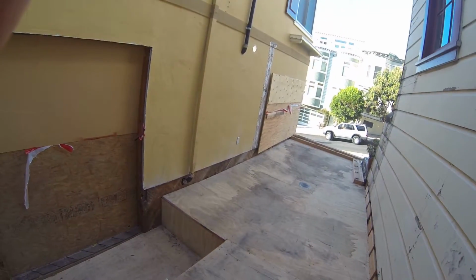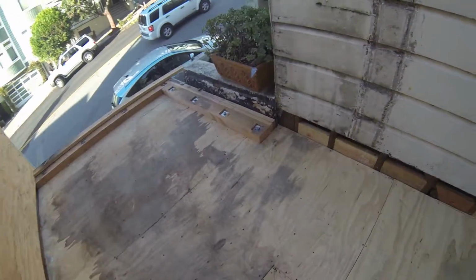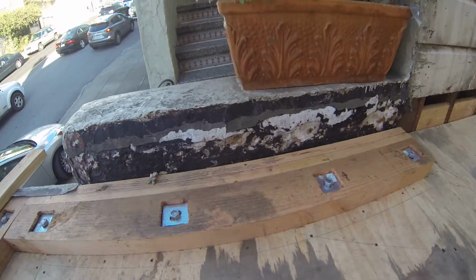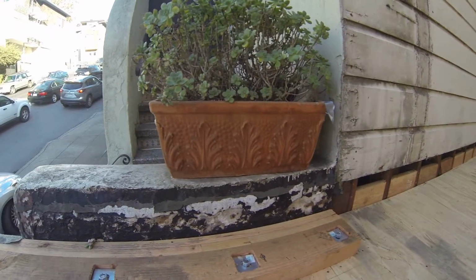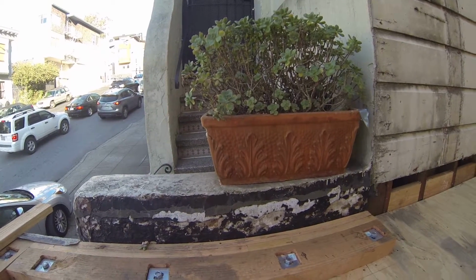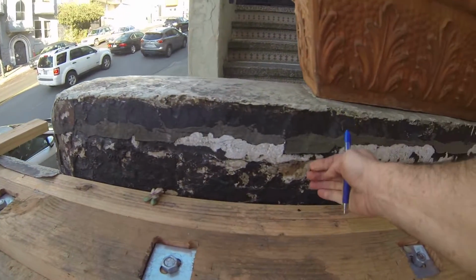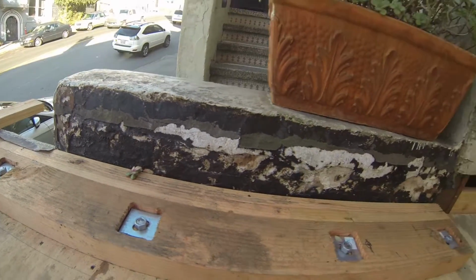Okay, and that's a door here, and that's a window opening over here. You're going to have to bring your screw gun, hammer. Oh, the other detail over here, what we're going to do is we've got this nasty wall here that's got tar on it, and it's not very pretty looking. I have a thought, and it goes something like this: take a piece of Duradek and actually put it onto this wall first and have it come down onto the curb, and then our real piece comes up and over, and we secure it with L-trim up top.